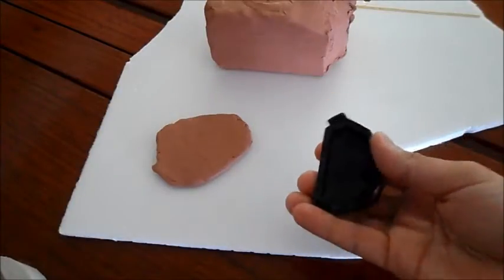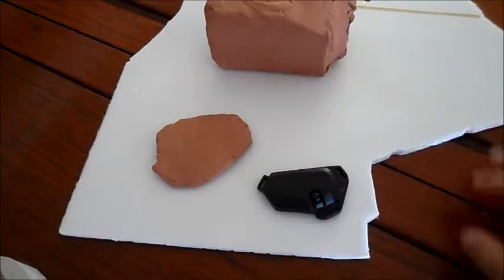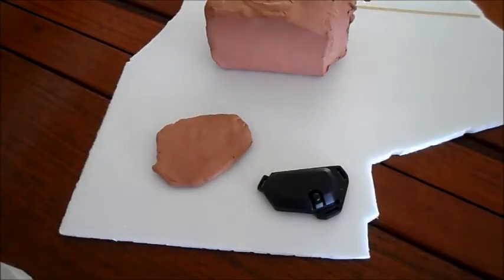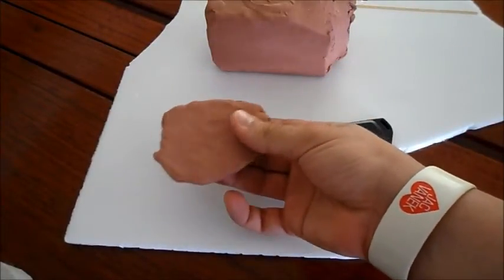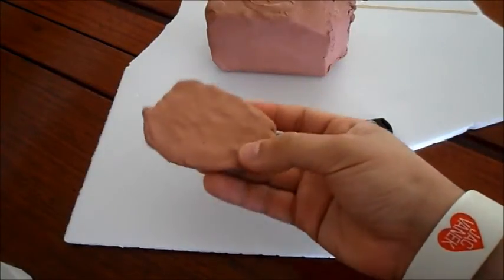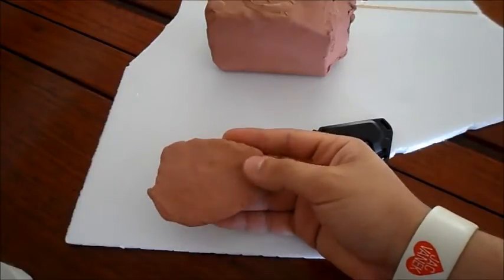All you have to do is find a way of separating the actual part into two pieces. Now, most people use clay for this. If you're going to use clay and you're using silicone, you have to make sure you use something that has no sulfur in it, because sulfur inhibits the cure of silicone. So what I'm using here today is NSP, which stands for non-sulfurated plasticine, I believe. And I'm using the soft version, because for molding purposes, it's a lot easier to manipulate.